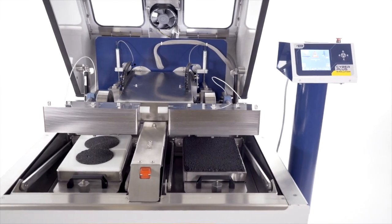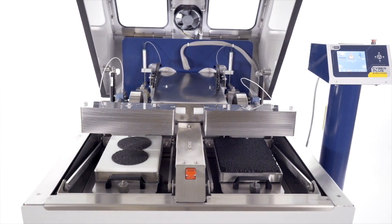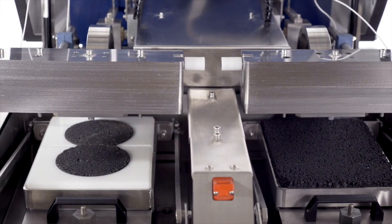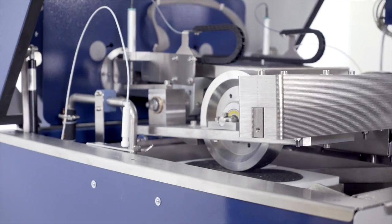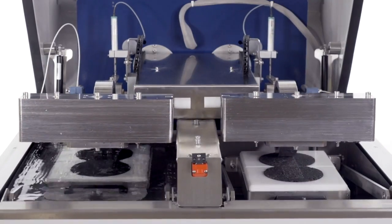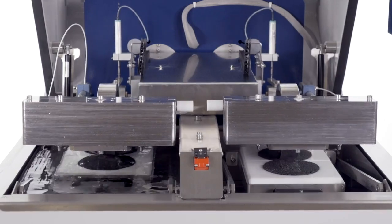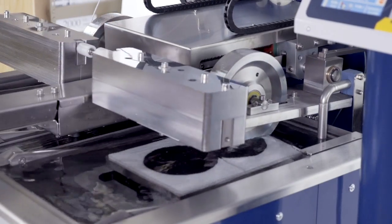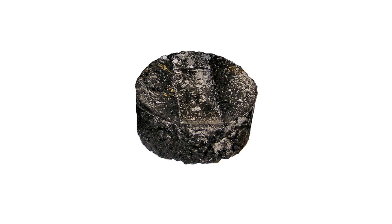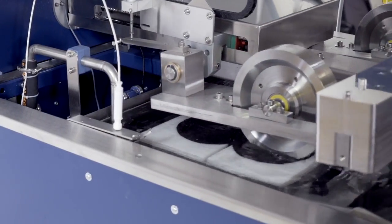Under the hood, the SmartTracker's innovative features continue. The SmartTracker is built on a rigid steel frame with stainless steel internal parts. All components are carefully designed to withstand the rugged construction laboratory environment. A unique three-tank system allows the user to perform wet and dry tests simultaneously. Each wheel is controlled by two independent motors — if one side fails, the adjacent sample will not be affected, assuring separate rutting analysis of each specimen.